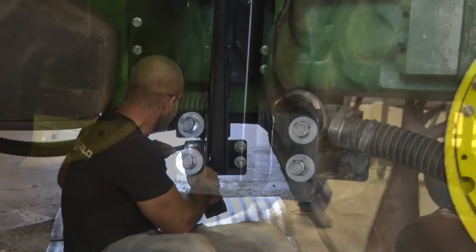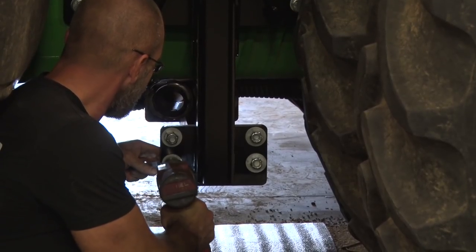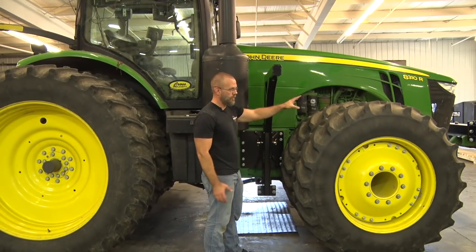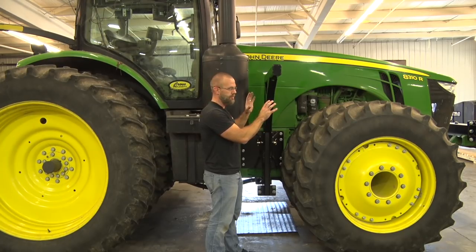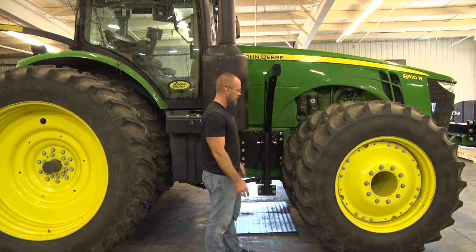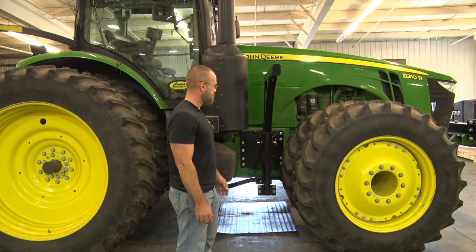While you're down there, you can go ahead and tighten up the under tractor support using a 15/16 wrench and socket. We're leaving the mount plate bolts loose and the front weight brackets loose just in case there's a little bit of stack up tolerance. It'll allow you to drop the tank support in place and move around a little bit and negotiate the tolerancing just a little bit better. Once that's on, then we'll go back and tighten everything down.